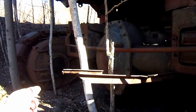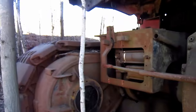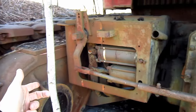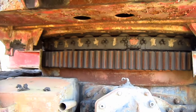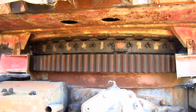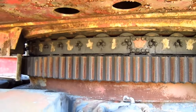Right here you can see where the trailing cable would connect to bring power to the machine. And here you can see where the propelling gear and axle shaft connect to the crawler frame. In addition to having a larger undercarriage than the 270B, the 280B also featured a larger diameter swing circle. Here you can see all of the individual rollers, which will rotate the shovel around the swing circle when the swing gear engages.